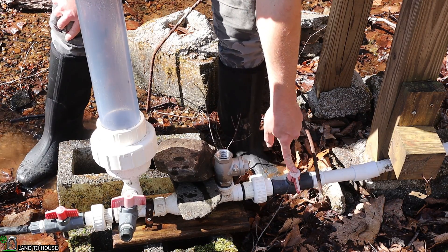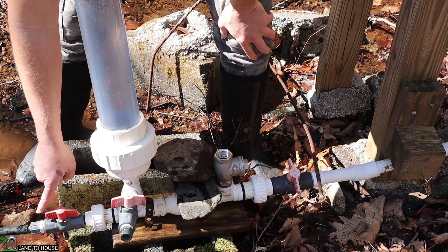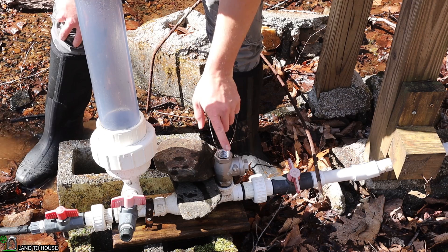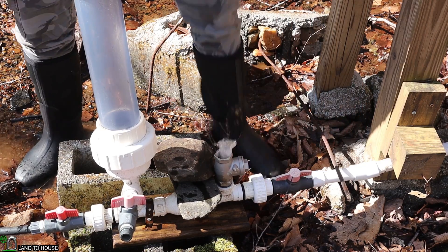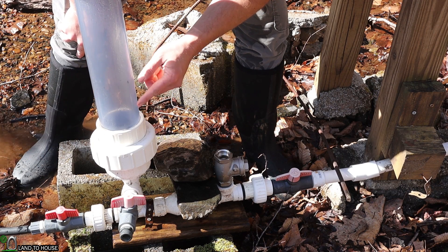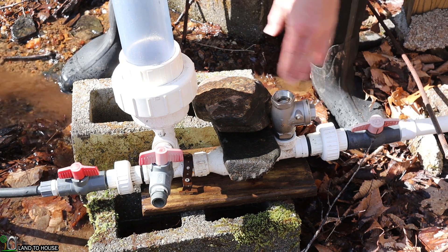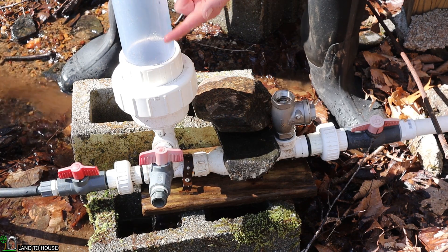When I open up the drive pipe, water is going to shoot out and close that valve, then send water through the pump and fill up the delivery pipe until it reaches the same height as the source water. After that, the pressure tank will fill and everything stays still. I'll have to push and cycle this valve until there's enough water in the pipe to keep the pump going. Let's go ahead and turn this on. Water is being sent through the delivery pipe. I gave the pump time to send water through and for the air to leave the drive pipe — an air bubble can cause the pressure wave to reverse too quickly and stop the pump.